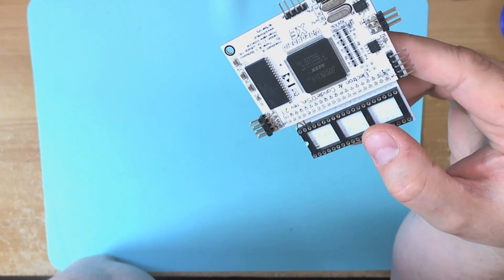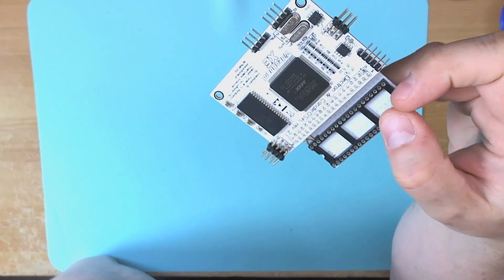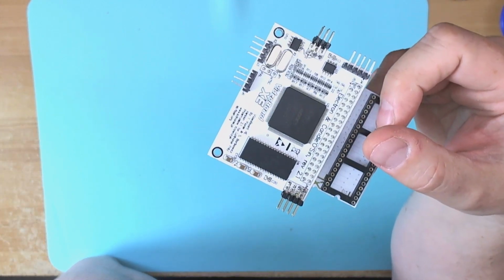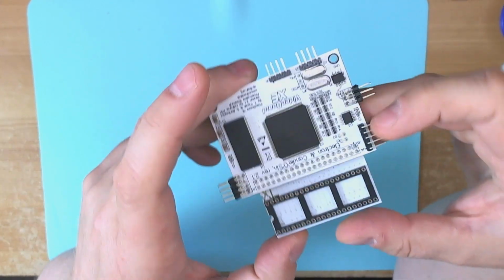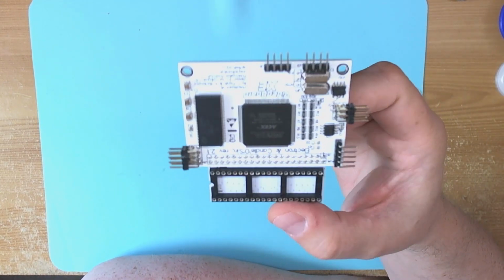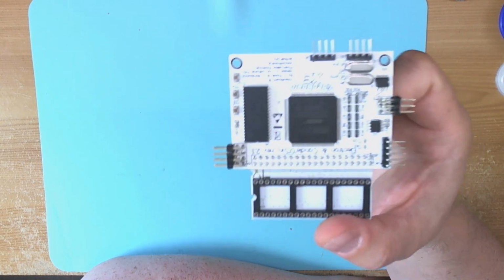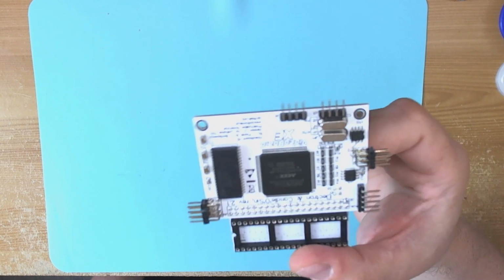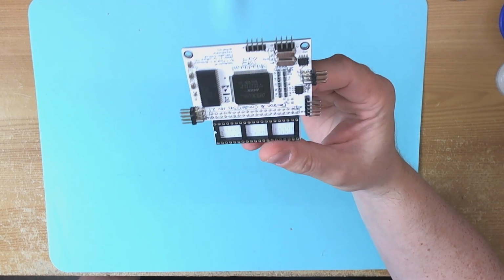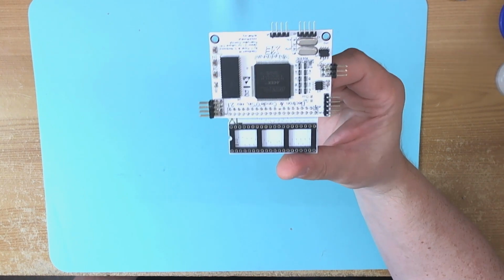These have been around for about a decade now. Excellent video quality. It can be a little hard to find a monitor that will display this signal. It's perfectly fine with SCART equipped televisions and monitors, which we have quite a lot of in Europe, but sadly it's much more difficult in the United States to find something that will display 15 kHz RGB, so you may have to get a scan doubler, which makes life a little bit more difficult.